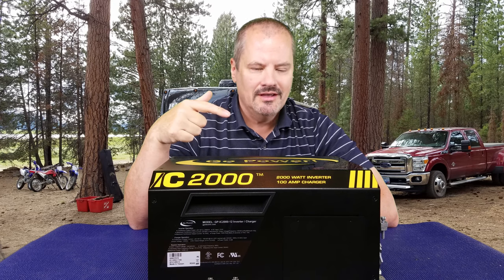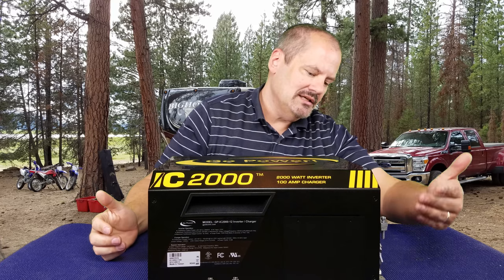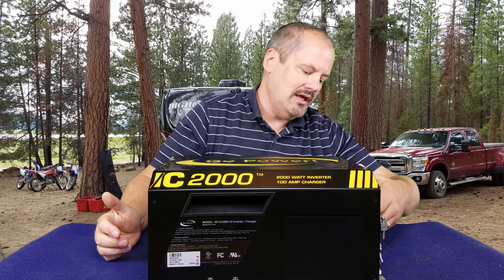What the device does is it's three devices in one — it replaces a lot of devices inside your RV already. It's an inverter, so it creates AC power from your batteries. It's a converter, so it converts shore power when you're plugged in at home or at a campground to 12 volt, which supplies that to your RV and also charges your battery. And finally it's a transfer switch, so it has intelligence inside to determine if you are creating power on the inverter or if you're plugged into shoreline power, and routes it accordingly. The device takes AC in, has an AC line going out to your distribution panel, and then there are two connections for the battery.